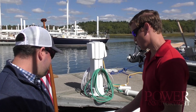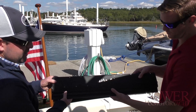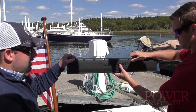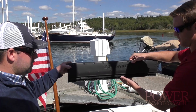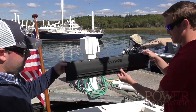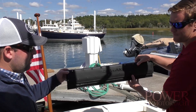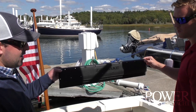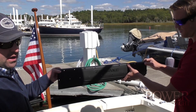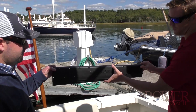So we have a model here — can you walk me through how it works? This model here is the largest interceptor in the range, the 750. This would be flush mounted directly on the transom. The blade comes straight up and down vertically, as opposed to a trim tab that comes back off the transom on an angle. That's a full stroke there — you're looking at 30 millimeters of deployment, just shy of about an inch and a half. It's amazing that the performance numbers are really coming from just an inch and a half. Because it's flush mounted, you don't have anything hanging off the transom. At neutral, reverse, or lower speeds, they automatically retract, so you won't hang up a fishing line or a dock line when backing down.